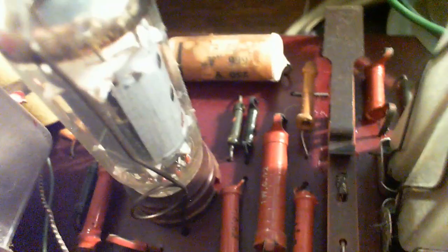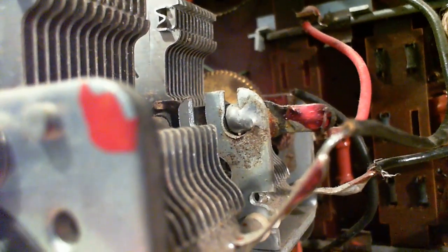What is that that has contaminated it? There's some there, some on the edge of the capacitor. Yeah. So they've soldered that wire onto the top of the capacitor, and then this junk is showing up. Maybe that's resin or something, like rosin. Maybe something similar here. Something appears to be corroding the metal though. Is there anything up higher that can drip on it? What can drip on it? There's nothing up there. That's the roof. There's nothing above it that can drip on it. Here's another example of some solder, and then you can see rust below it, where some chemical in the rosin probably. It could be acid core.